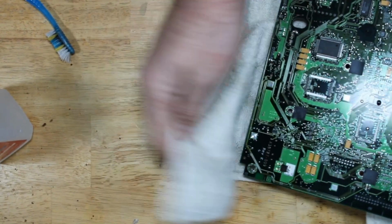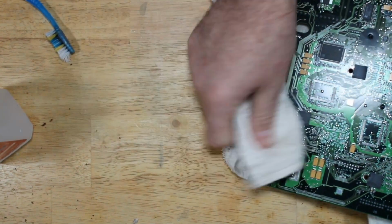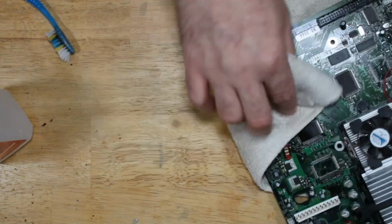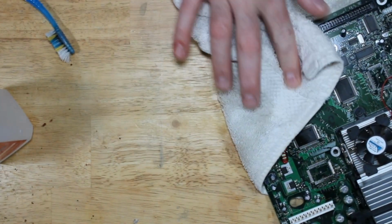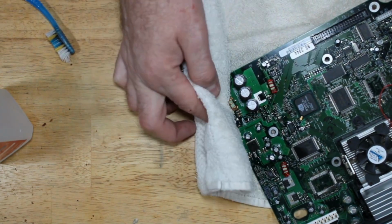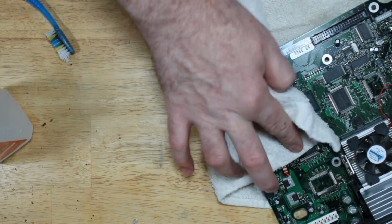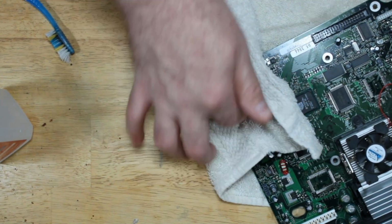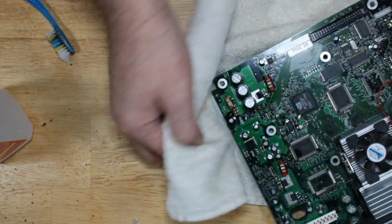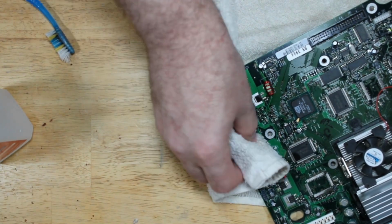Just going to pat this side down. Pat the other side down in the areas where I can. Just get the excess moisture off. Be careful not to bend anything. Just kind of stick your fingers down in the area and touch the board, and that's enough to dry up most of the liquid. Then let this dry in front of a fan